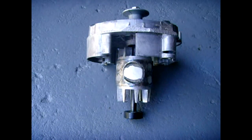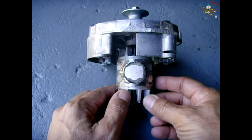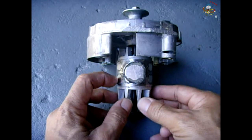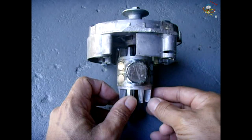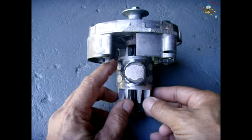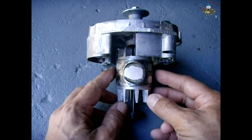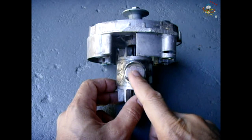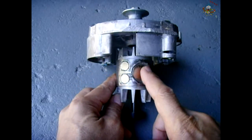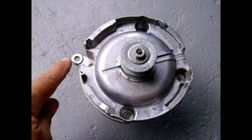Here's how I modified the rotor for the 3450 RPM two-pole motor. It requires a north-facing side and a south-facing side. I took five magnets: two smaller half-inch by quarter-inch N50 neodymium magnets on each side, and in the center one one-inch by three-eighths N40 neodymium magnet. All magnets on one side are north-facing, and all on the other side are south-facing. For a four-pole motor, I would have simply used four large magnets alternating north-south-north-south.